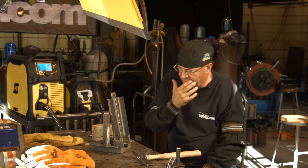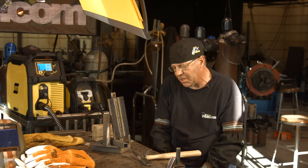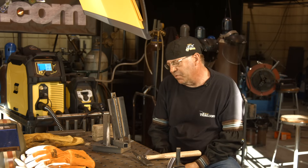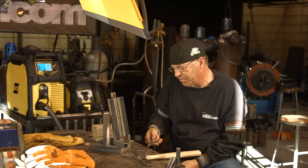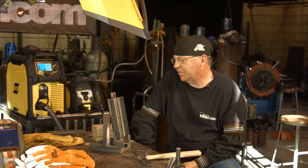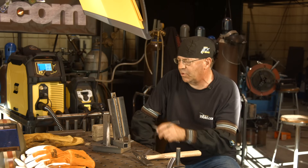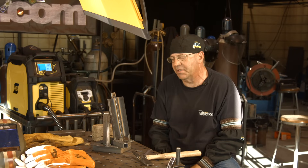Pretty impressive stuff. I've used it a lot a long time ago and I teach with it. I teach a lot of different flux core wires, but again we had a viewer request: can you do the backing strip with the flux core? We do a lot of this on half to three-quarter inch plate with .045 wire and bigger, running multiple stringer beads in a lot of different positions.